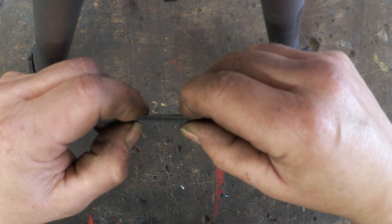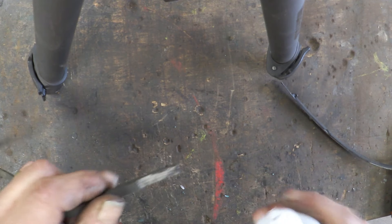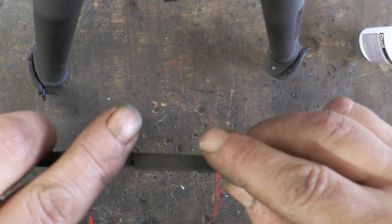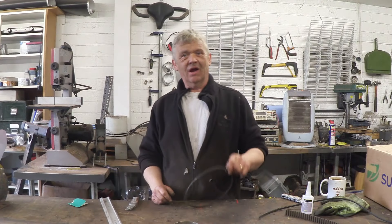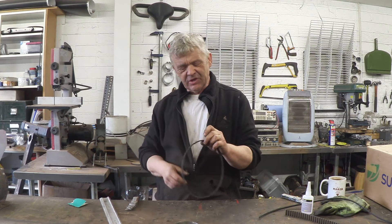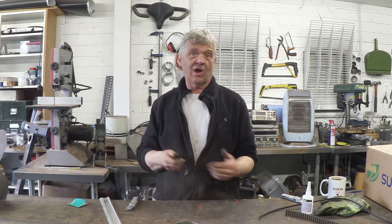Scarfs can be angled or joined like this — there are many variations. The glue I'm using is super glue; it makes the joint a little stiffer, but it works really nicely. Contact cement, rubber cement, or lots of other glues will also work well. All we do is line them up, join them together, and put a little bit of pressure on until the glue dries. What you end up with is about the right size with one tough joint. If you're still worried, put some stitches through it too. Super glue is a little stiff, but a couple of bends actually unstiffens it.